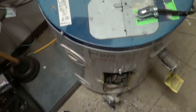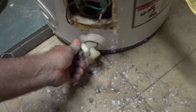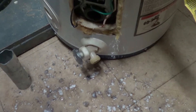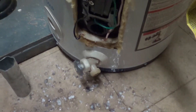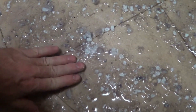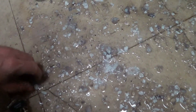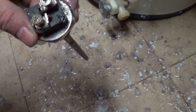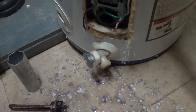It's in another side of the room, but this is just disgusting — the amount of crap in here. I don't remember it being this bad last time. I undid the valve and nothing really came out, or it came out very slowly and then stopped. But the weight just felt all wrong. When I undid the element, the amount of crap that came out was amazing — it feels kind of like cottage cheese and has a little bit of a funk to it. There's the dead 1500-watt element; these are really cheap to replace.